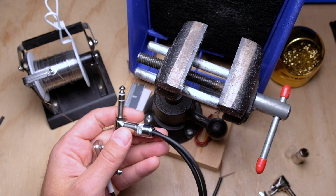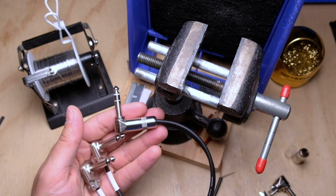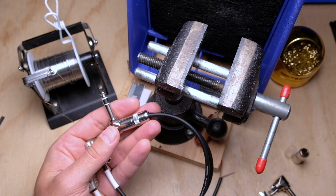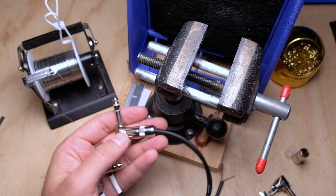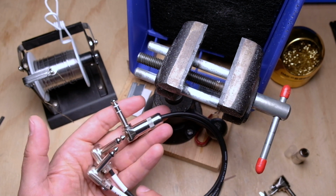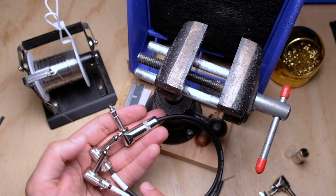The second one, and what I'm really going to focus on today, is more for a pedal board build. There are at least two major manufacturers that use stereo pedals, but instead of having separate left and right plugs on the pedals in order to save cost and space, they just use a single TRS jack, and then you build these insert cables and it allows you to split it out. So it's really more of a stereo cable in this case than an insert cable.